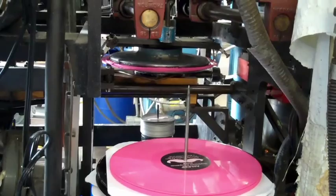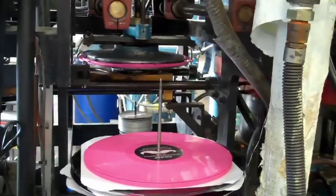Right now there's a record being pressed — this one's going to open in a second. If you go around the front you can see a press release here. The record stays on top, the biscuit will come forward, and the other record will drop onto the trimmer table and go back to make another record.